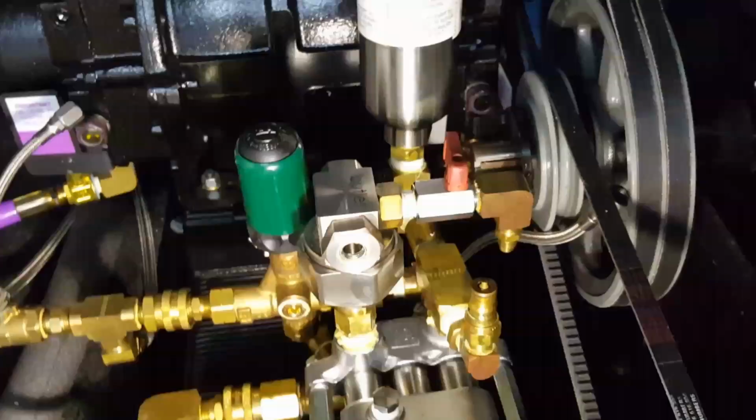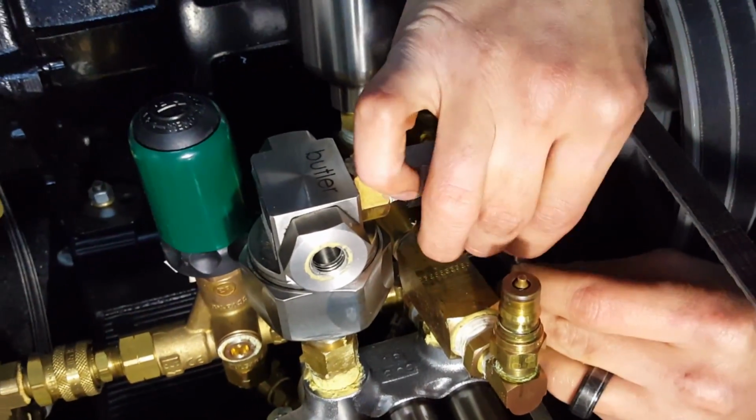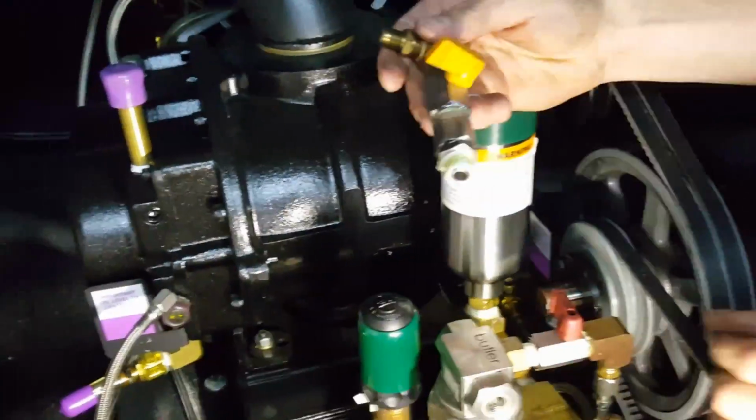We'll let him finish that up. All right, he has it in position basically. We're going to take and pull that hose there. Again, no Teflon tape or anything needed. That's the hook up for the bottom side coming out the cat pump for your bleeder. Again, those are 1/2 inch. We'll get them snugged up by hand. We'll snug them again with a wrench at the end, compression.